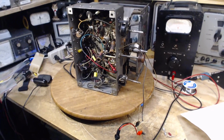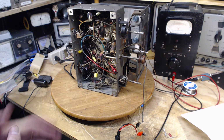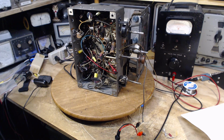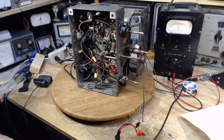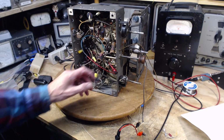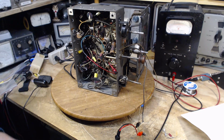Why am I here? So, I ended off the last video with the conclusion that trying to restore this coil, or this transformer, is not really possible for me. I suppose you could experiment a lot, making windings, but I think in the end you wouldn't get all that far. These coils are wound very carefully to achieve specific operating conditions, specific impedances and things like that, and any disturbance in the coil is going to throw that off. It's kind of a knife edge arrangement, so when you slide off the edge, you go down a long ways.